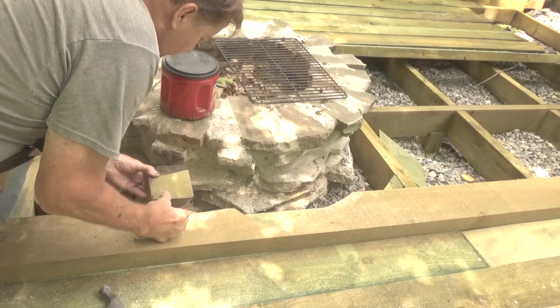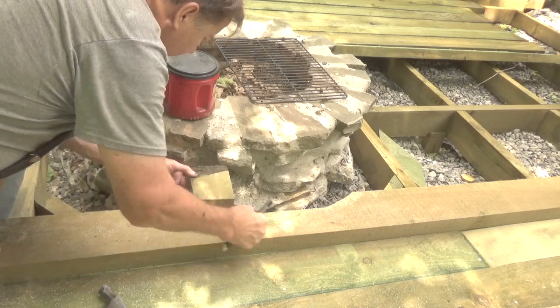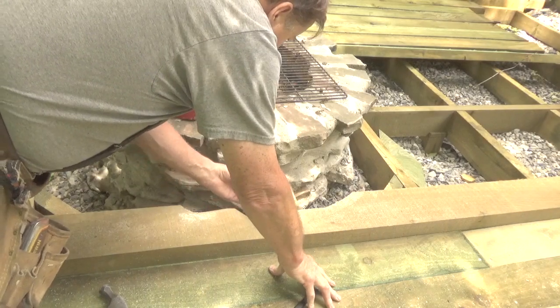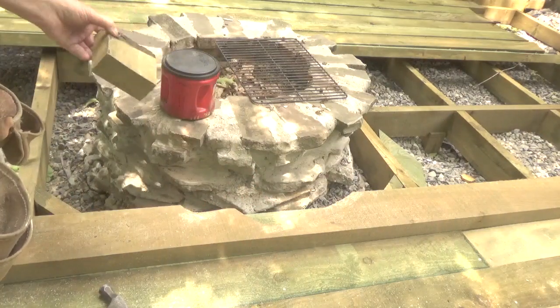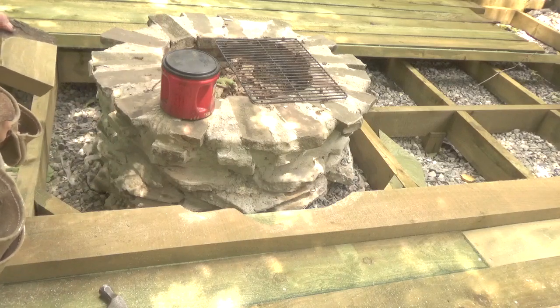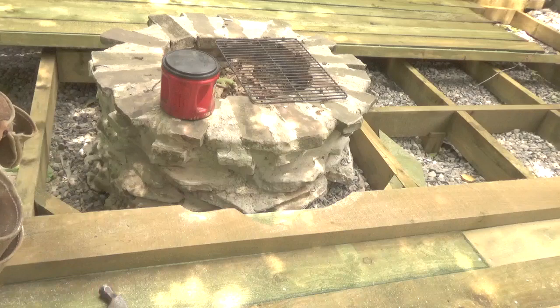And what you do is you go around the rock, and I'm staying a half an inch away roughly, and then I've got this one that juts out here, and then it juts back in, and then this one juts out a little, and that's how you mark that board. Then I just cut it with a jigsaw. Okay? So it's not really hard to do. You can use a set of dividers as well.